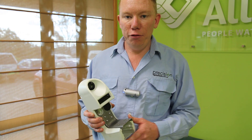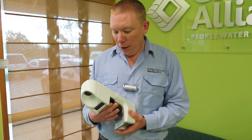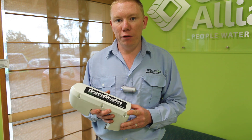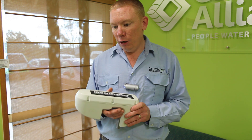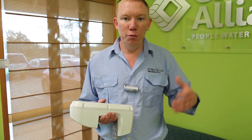So it transmits infrared and near-infrared light and it's picked up by the receiver. And then it converts that into the NDVI index basically on the fly. This is really good because it gives us a normalised index which we can compare between years and between crops.